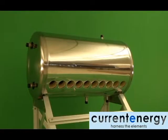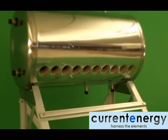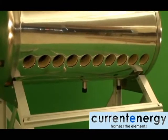The tank has multiple fittings. The two you see here attach to the copper coil which is inside the tank. The copper coil allows you to have pressurized potable hot water. Whenever you are adjusting any of the fittings on the tank, it is a good idea to drain the tank first in order to avoid scalding.